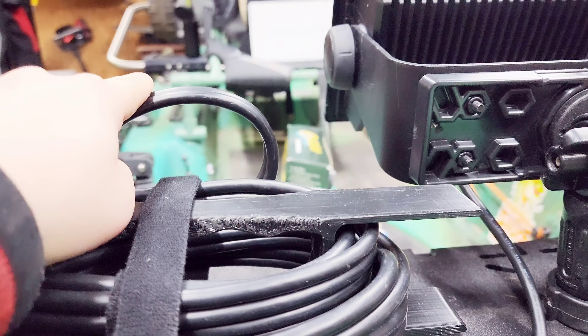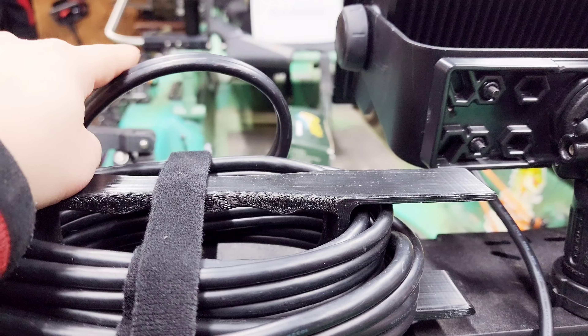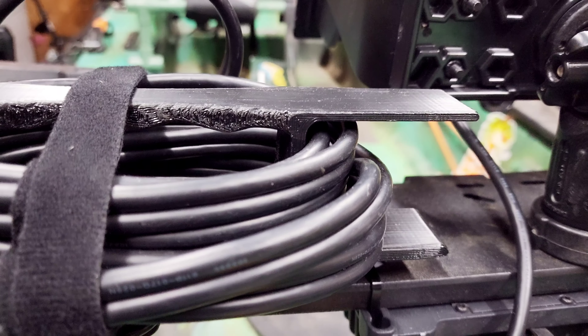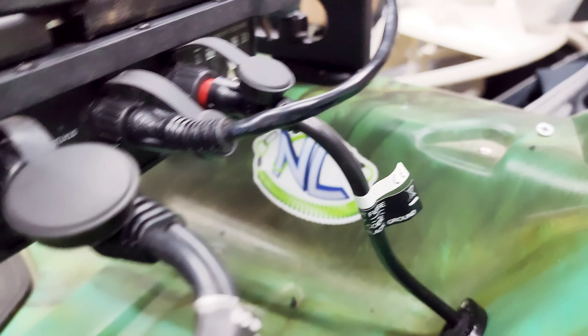Moving on to the front side with the four-inch hatch — for the relay, I'm only using two wires. Inside is pretty messy, but I had to run my wires all the way from the backside to the front side. I took a broken fishing pole, taped the wire in, fed it through one of my rod holders in the back, and then pulled the wire through. Here the wires come over for the fish finder. I wired the GLS10 as well as my fish finder, the 943XSV, and spliced them together so I didn't have to run multiple wires — which works well. I did the same thing for ice fishing too.